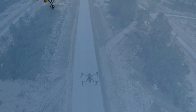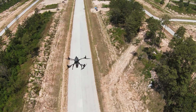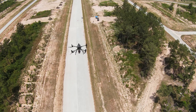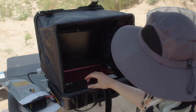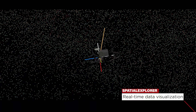With the photogrammetry package, DJI M300 operators can simultaneously acquire survey grade LiDAR data and high resolution 61 megapixel imagery at up to 100 meters above the ground. The Mini Ranger 3 Lite boasts up to five returns per laser pulse and offers extended UAV flight times for various mapping applications, including utility infrastructure, land erosion, glacier and snowfield mapping, and more.